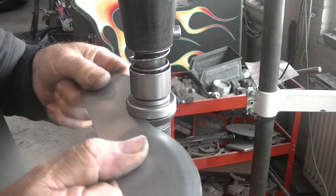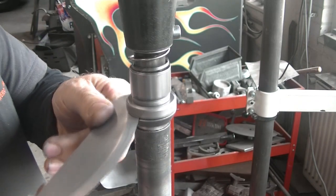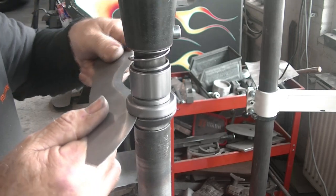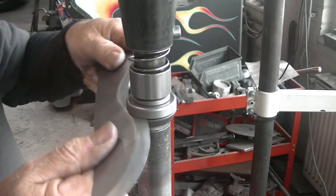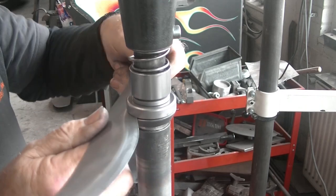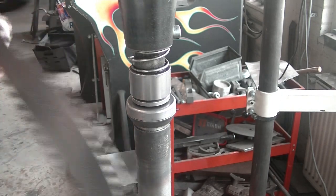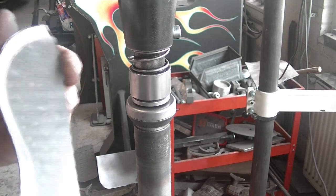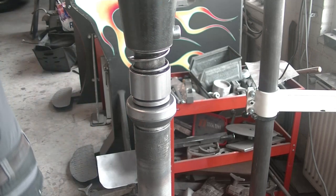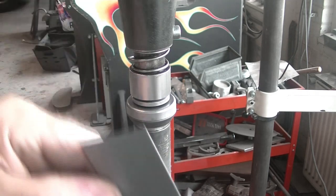In between, I show you how easy it is to tip an edge on the Mechammer with the tipping dies. In this case I use a 10 mm offset. Now it is time to tip the edges of the curved panel.